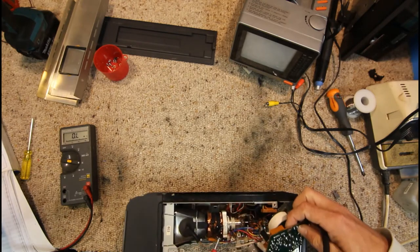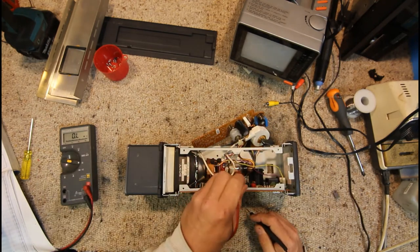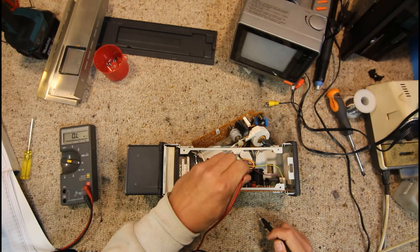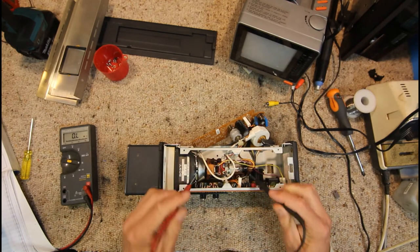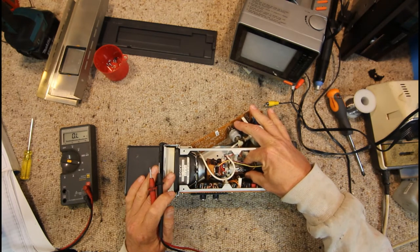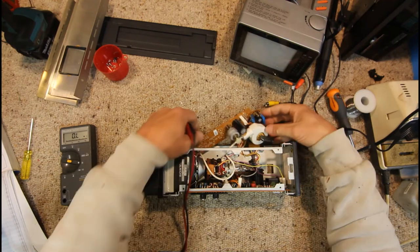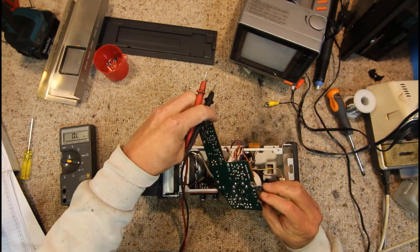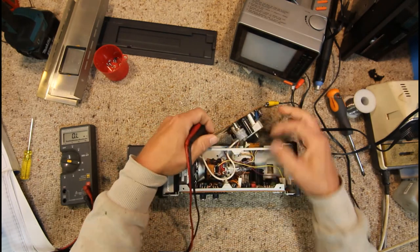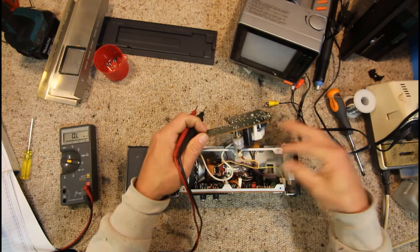This other wire goes to the picture tube — I can actually see it going into the heater coil, which has whitish-looking wires running right up through the center of the circular pieces in the picture tube. So we must have a 12-volt heater, because it can't be 6.3 volts if regulated. There's a 16-volt 220 mic capacitor there, suggesting this may be a 12-volt heater in the picture tube which is an odd one.